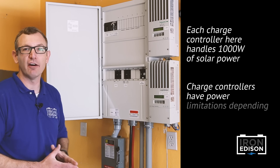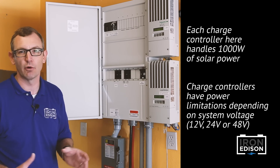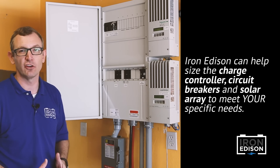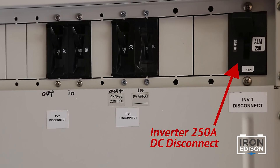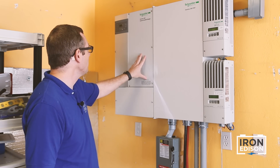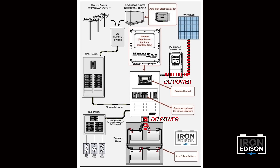These digital maximum power point tracking charge controllers are able to take the low amperage high voltage power coming from the solar array and very efficiently step it down to a low voltage high amperage output that's ideal for battery charging. The charge controllers do have power limitations, and they're different when the system is installed with a 12, 24, or 48 volt battery. At Iron Edison, we're happy to help you understand and do all the calculations required to size the circuit breaker, the solar array, and the charge controller to meet your specific needs. Also housed within the power panel is the inverter's DC disconnect. This will allow me to turn on and off the inverter, which is the main piece of equipment that takes the direct current or DC from the solar and battery system and inverts that direct current into alternating current or AC. This is what our standard household appliances use for everyday power.